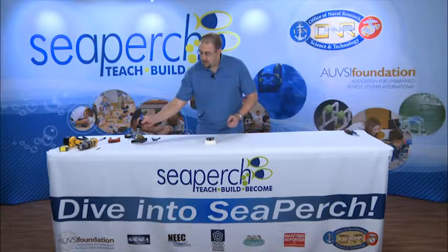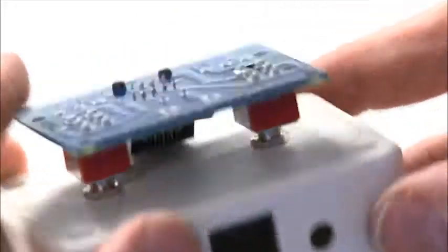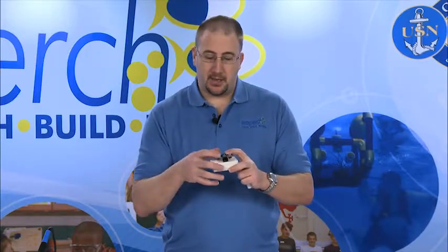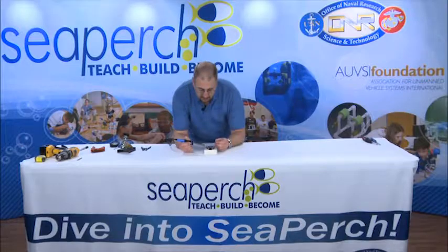With the printed circuit board, before we go and do the next set of joints on that part, we want to make sure that everything is down and flush and in place. It's much easier to adjust one of these switches with only one terminal soldered than it is with all the terminals soldered. Once we're happy, we can go ahead and solder up the rest of those connections.